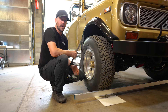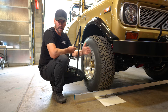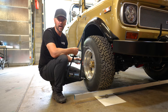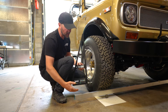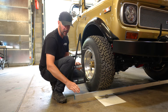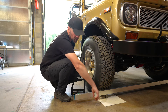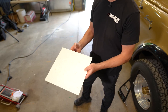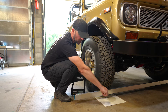So if you're measuring camber on an uneven surface — which for us is our shop floor, it's pretty level but not dead level, so we'll call it uneven — it could be the racetrack paddock on lumpy asphalt or in a gravel driveway. You just need to create a new horizontal plane that gets you up off anything that's uneven. We try to use stuff we can get easily from a store. These are some square floor tiles, but you could use aluminum squares, pieces of plywood — it just needs to be a little patch that normalizes the lumpy ground underneath.